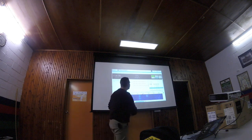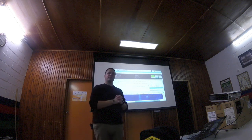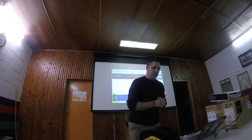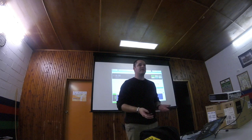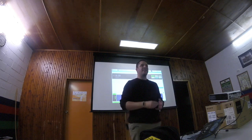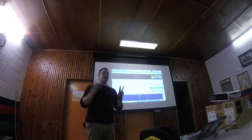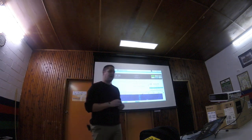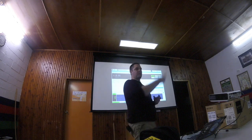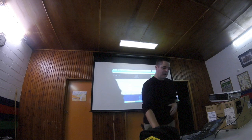So where was Pete on the waterfall? He was down there. Yep, so there's Pete. He's actually responded straight away. Yes, he's ready. So it's working, we're decoding stations. The problem is we've put a decent antenna up tonight, so we're getting decent signal reports, but it'll decode down into the negative 20s. If you're running the quote-unquote suboptimal setup that I'm using at home, I can work all of VK and most of ZL on 80, and on a good night up where we are in North Canberra, we can easily work the US on 80.